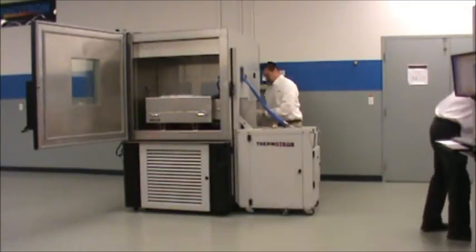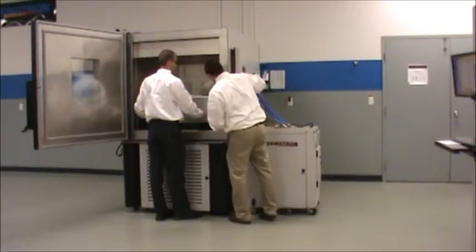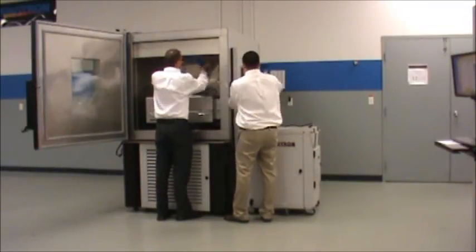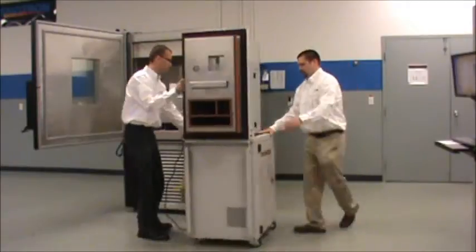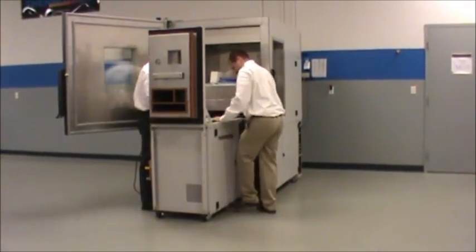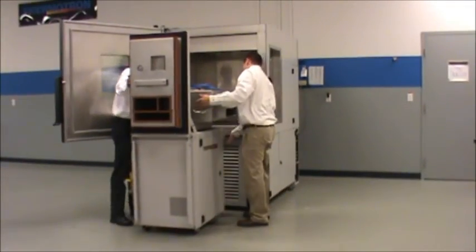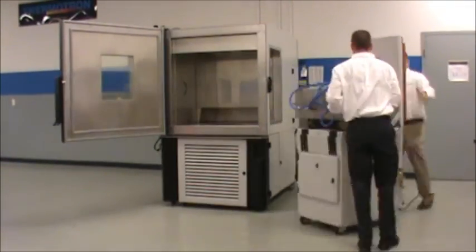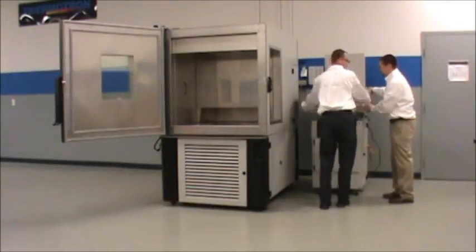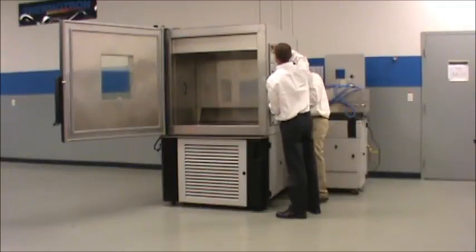The controller features endless graphing capabilities, service messages, and in-depth report generation. Each of the four impactors has individual air modulation that smooths frequency response and improves vibration control. The 16-inch by 16-inch, 150-pound table is designed for use in a chamber and can be configured for worldwide use. The table's acceleration levels are from 5 to 60 GRMS and 0 to 10,000 Hz.